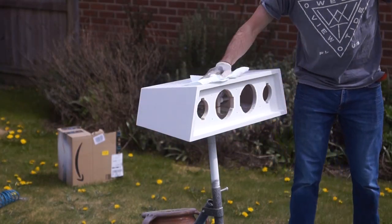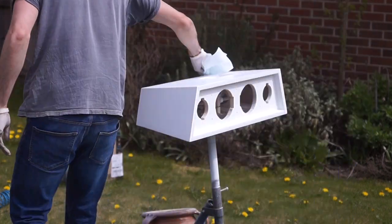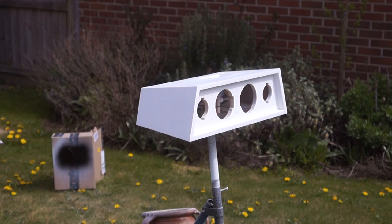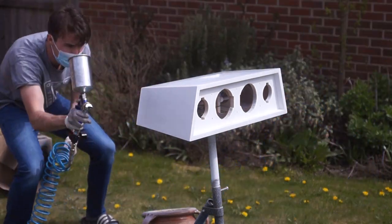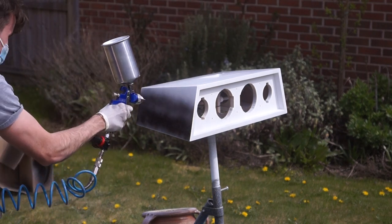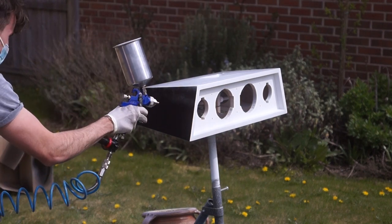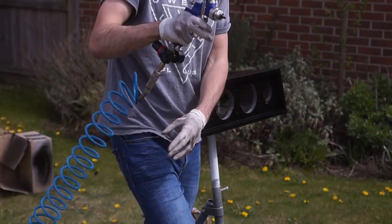And I also had to mix it and clean it with white spirit, which is just a real mess compared to a water-based. Cleaning it off with some isopropanol alcohol, making sure it's nice and clean, and then coming around with a gun and just doing one pass per layer. And I had the wrong consistency here. It was way too thick, and I've just got a horrible spray pattern. For that reason as well, I overcompensated in some areas, and I ended up with streaks running down it.